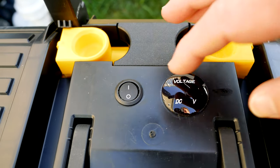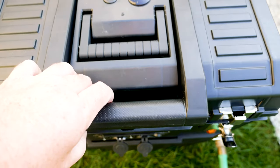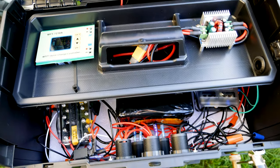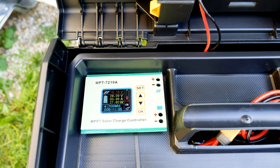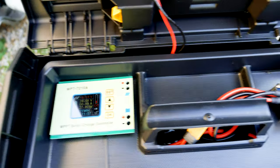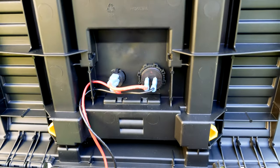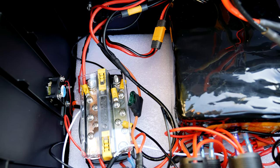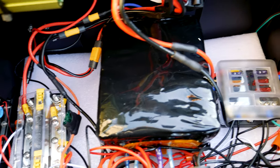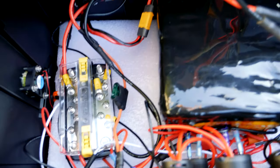I've included an always-on voltage meter on top of the unit for easy access. Inside the top tray there is an MPPT 7210 step up charge controller on the left side for solar. A 300 watt buck converter is located on the right side for voltage step down for the 12 volt bus and accessories. Inside the box the 24 volt bus is located on the left, a 7S6P battery is located in the center, and the 12 volt bus and wiring is located on the right side.